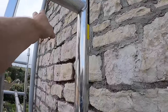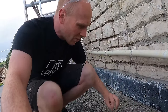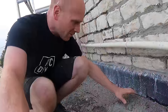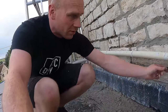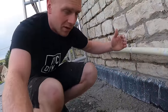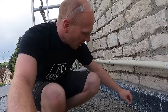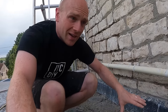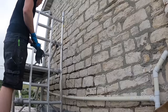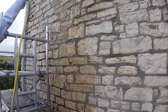We've got all of that to bash back — this is our last section up to the corner and then run down here. Without being too cowboy about it, we also realized that a lot of this muck that's fallen down is just lime mortar and it mixes up just fine. So for the deep spots and voids we need to fill, we're actually using this reclaimed stuff — it knocks back up really well. A few stray bristles from the brushes to remove, but apart from that it's a good way to use it up and hopefully get all of it done in one hit.